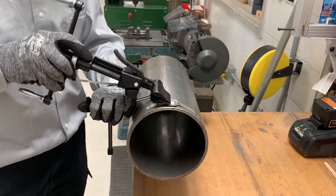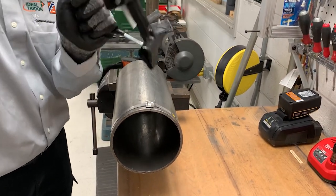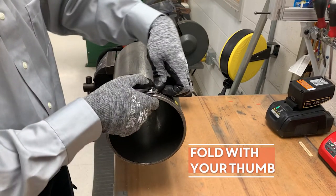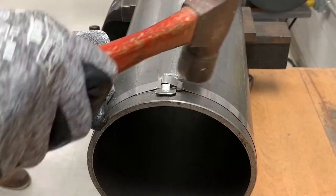Once this tension has been reached, roll the tool over the buckle, lift the cutter lever, and cut the band. Fold the stub of the band with your thumb and complete the application by hammering the buckle ears over the stub.